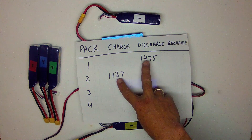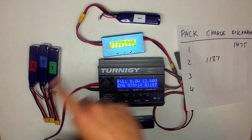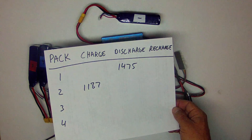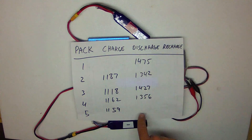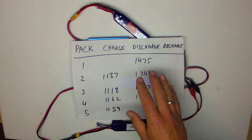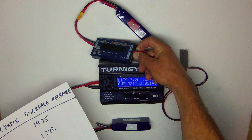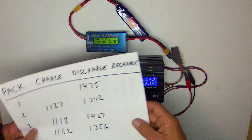There's certainly some loss of current there. I'll continue rotating — using this one to charge the next one — discharging one, charging the other, then recharging them normally to reconcile and double-check the discharge milliamp hour readings. I then took charged battery five to try to charge back battery one, but since the state of charge started at about 11.5 volts from the factory, it didn't have enough juice to fully charge it. The voltage dropped to 11.2 volts, which is a level I don't like to take my batteries below, so I arrested the experiment at this point.